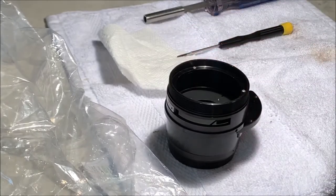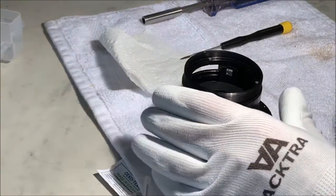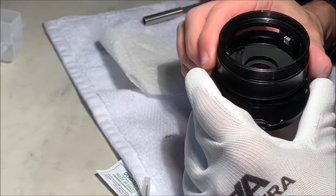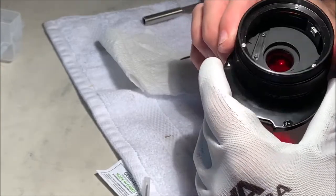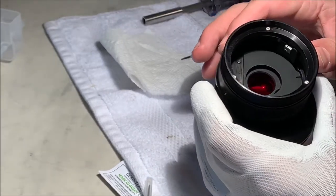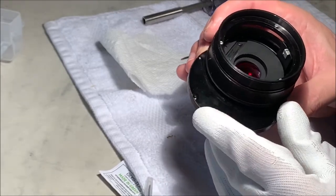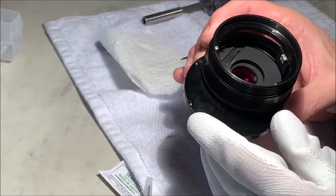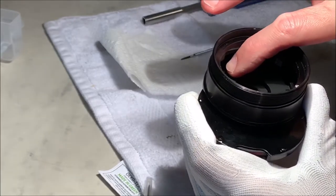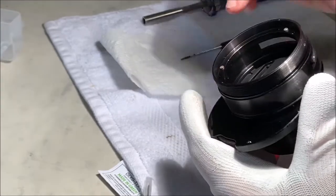On a project where you've never gone before, there's a lot more looking and thinking and guessing. My guess - first of all, that little metal strip with two screws - I'll bet that is restraining some kind of a spring detent for the filter rotor. I can also tell that this element I got loosened is not going to come out as is.